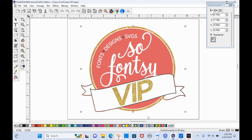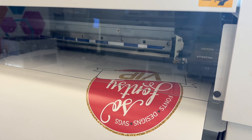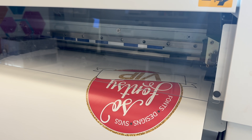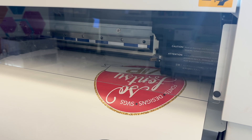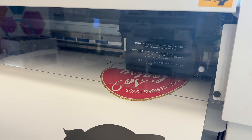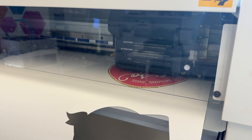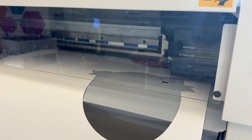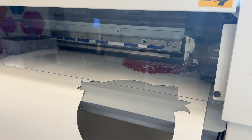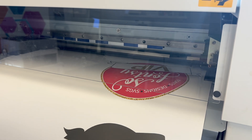Let's watch this — there should not be any delay after printing and before cutting. The printing is now finished, so now instead of getting that post print feed, it's immediately going to begin cutting. You can tell by the way the blade is moving — it's not moving in one smooth line. It's cutting, picking up, cutting, picking up. That is the perf cut, because with perf cut you need part of the material to stay attached to the little tab. When the blade picks itself up, that is where it's creating the tabs. When it is complete, we'll be able to just pop out the decal, just like that other one I printed and cut earlier.